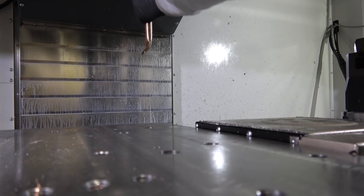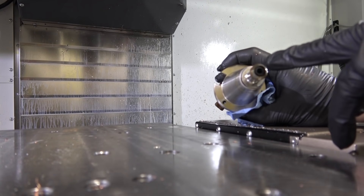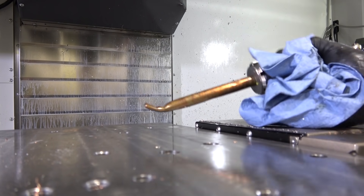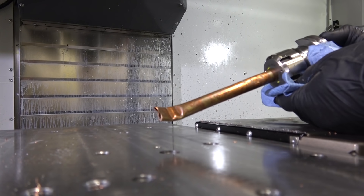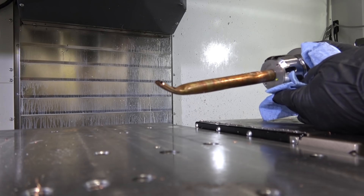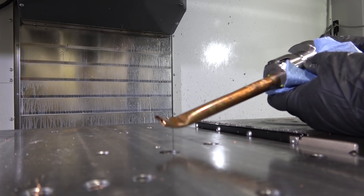This one's just a copper pipe in a collet, sealed up. This machine has through-spindle air blast as well as through-spindle coolant, which comes in super handy. So if you're looking at a machine, it might be worth it to get the through — you can actually put it in after the fact for quite a bit cheaper than the factory supplies, but it depends if it's your dimes or the bank's.